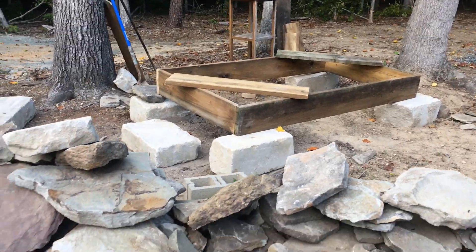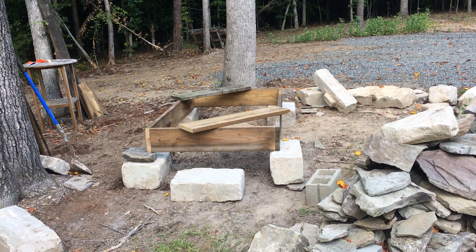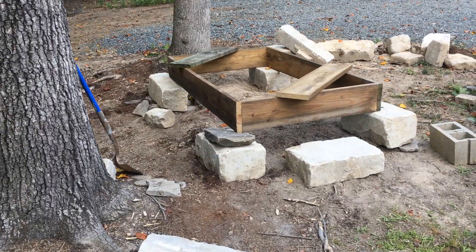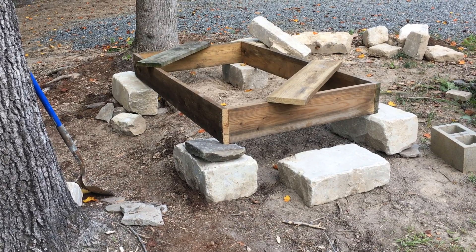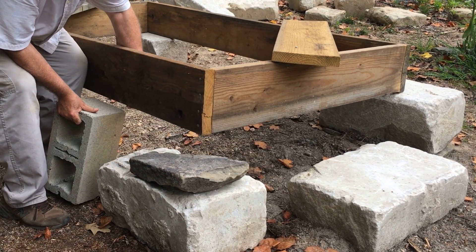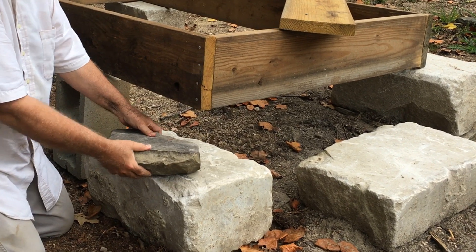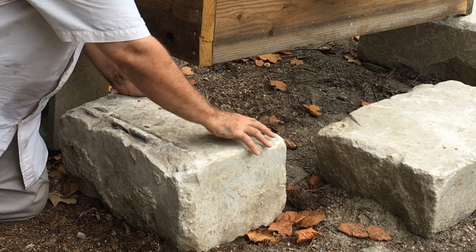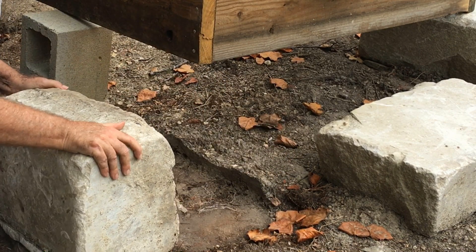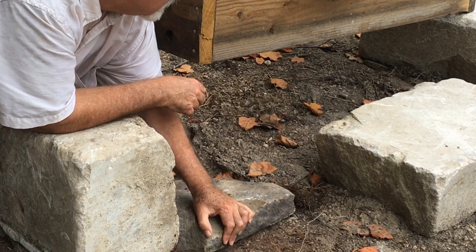I just leveled the ground out a little bit — took a few inches off the top to level each of the rocks. I went ahead and framed up a floor system to work off of. It made things easier to square up the foundation by having this frame to reference, and it'll make things easier when we put the logs up to have something to stand on. It was extremely hot and sunny the day Nick and I put those four stones in place, and one corner was lower than the rest, so we put a stone on top to give us a level spot. The next day, cooler, I came back and slid the rock over, put a stone underneath the bigger rock and stabilized it, then put it back in place — now I've got a nice level spot.